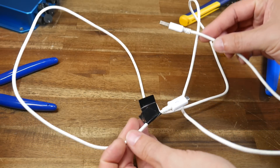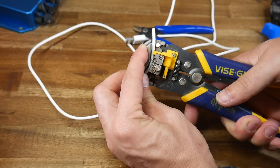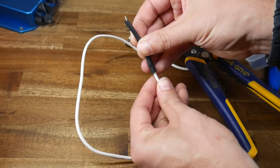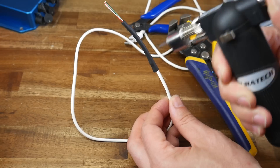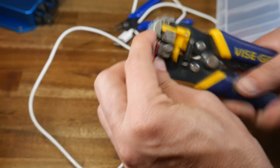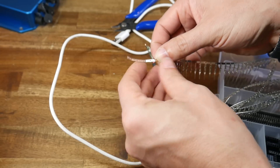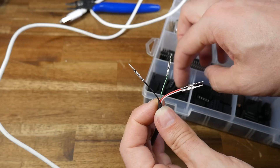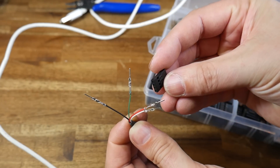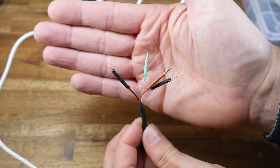If I can't buy it, I'll have to make it — so let's start with a crude proof of concept. I took a spare USB cable and chopped the end off, then stripped off the outer layer and folded back all of the insulation, exposing the four wires inside. A length of heat shrink is ideal for holding this back and tidying up the cable, giving easier access to the strands inside where I could strip off the end of the insulation. The next step was to terminate these wires so they could plug into the V-Box. I decided on male DuPont connectors, which were crimped into place. Rather than use a plastic housing, I insulated each pin with colour-coded heat shrink for temporary insertion into the port.